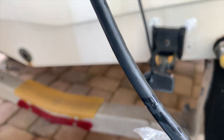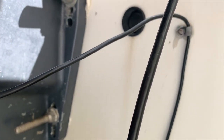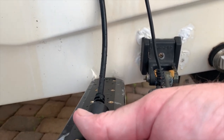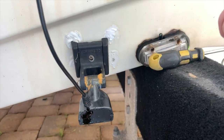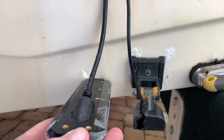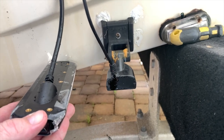Here's the new transducer and there's the old one — we're removing that. Got the cable for the new transducer all the way up to the dash. Now when you mount the new transducer, you want it to be level with the ground — not level with the boat on an angle. Level with the ground, at the base of the boat, nice and even. You want it right about level with the boat but not below the hull, and not angled with the boat hull.